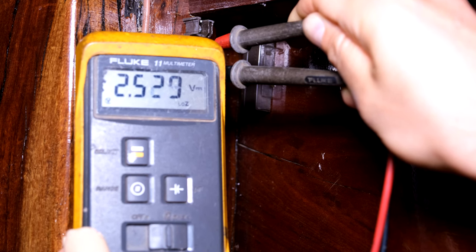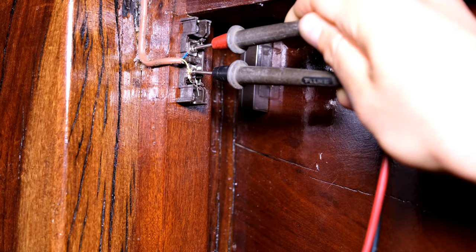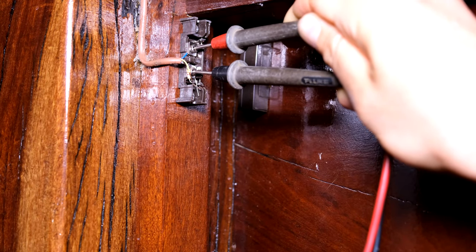If that is within the range of the correct voltage for your panel, you know that the wire is fine. You would need to find out the voltage for the zone to determine that. Now when I close the door, it should go to short circuit.